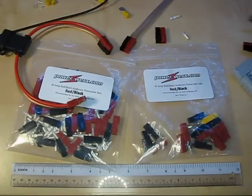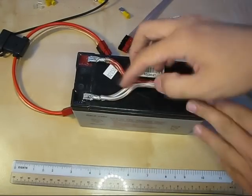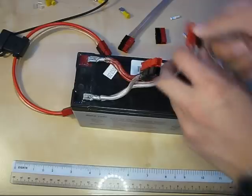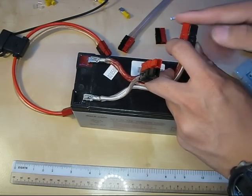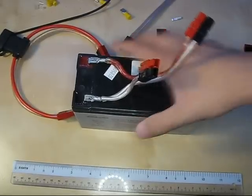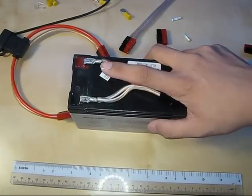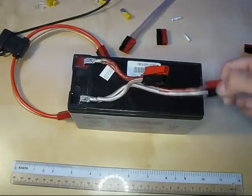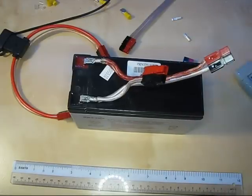Another application I have set up is for my 12 volt sealed lead acid batteries. I've made up connectors going from spade connectors to a pair of PowerPoles, so I can plug one pack into an adjacent one and string together an entire series of sealed lead acid batteries to make one large battery bank, or put two loads on one. I charge them using solar panels and can pull them out for a robotics project and slap them back into the charging bank easily. You can also use these connectors to make series connections — just be careful to use different colored connectors to designate higher voltages, otherwise you could end up with an electrical fire.